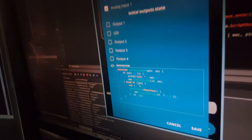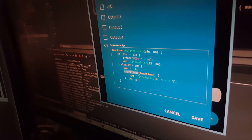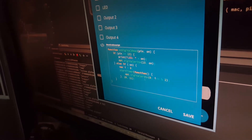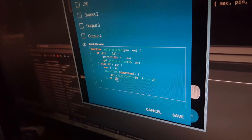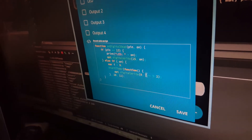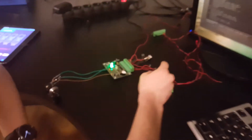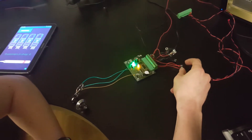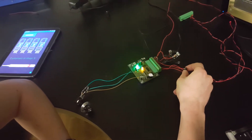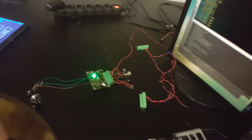Another script example: if the button is off (negated), a timer starts that repeats every 20 milliseconds, 11 times, writing 1, 0, 1, 0 and so forth. Pressing this button causes the buzzer to buzz in a pattern every 20 milliseconds, all running on the ESP module.